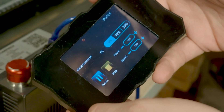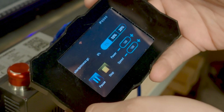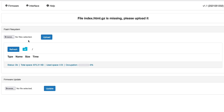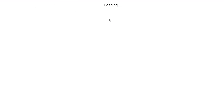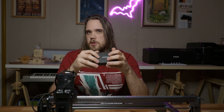For offline engraving, I would typically do it with jobs that have already successfully completed via Lightburn. Also with the touchscreen controller, there is the option to connect via Wi-Fi, though there isn't much reason to do so at this stage. The web features are still under development by Atomstack, but if you connect, you can enter your IP address via a browser and access a specific interface — currently it just allows you to move the X7 laser and access your SD card.